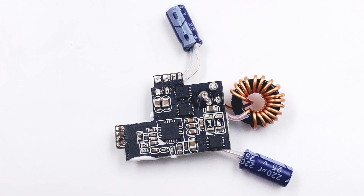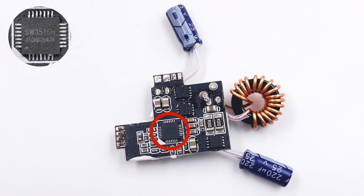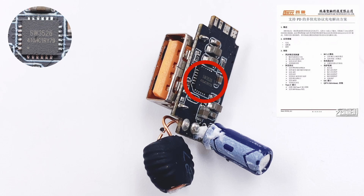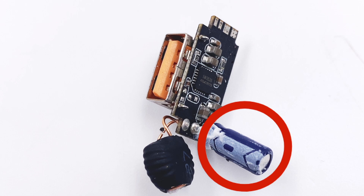The step-down circuit of the third USB-C port is on a separate PCB, also using the iSmartware SW3516H chip. The step-down circuit of the USB-A port is on another PCB, using the iSmartware SW3526, which integrates a MOSFET and a 3.5A high-efficiency synchronous buck converter, and can support output control of USB-C or USB-A ports. The output filtering capacitor for USB-A is from Yuguang, rated 25V 220μF.